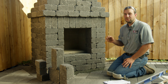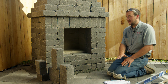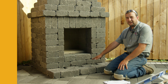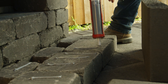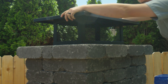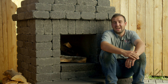So we're at the final step in assembling our Deschutes Fireplace Kit. We're going to install our metal chimney cap and put a trim piece in here, then do the layout for our hearth. Traditionally, you would set the base stones for your hearth ground level with the base of your fireplace, but since we have a paving stone patio that was installed afterwards, we're just going to lay it right on top to avoid some cutting. We just filled it with gravel — that's perfectly fine — and we're going to go ahead and lay our blocks on top of that. With these blocks in place, we can just put our hearth pieces right on top, and if we need to shim them a little bit, we sure can. We advise that you wait at least 48 hours before you have a fire in there to let that cement behind your fire brick cure. If you want to know any more how-to's for hardscapes, check out DIYwithWI.com.